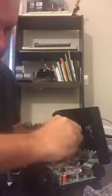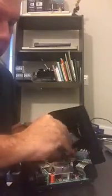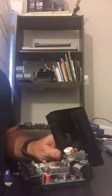Should go without saying, but I don't want you guys calling me and saying, hey man, I got the crap blown out of me because you didn't remind me to unplug my electronic stuff before I started working on it. That's not my problem, man. Whoever does that, that is your problem. Not that any of you guys would do that. This particular tube is kind of stubborn in the socket, and I don't want it to come apart, because if it breaks in the socket, then you do have your hands full pulling that out of the socket. So I'm using this little piece of bubble wrap that came with my new tube to work that tube out of its socket, and it came out. It was in there kind of tight, but there we go. What is this? Yeah, this is the made in China 12AX7.